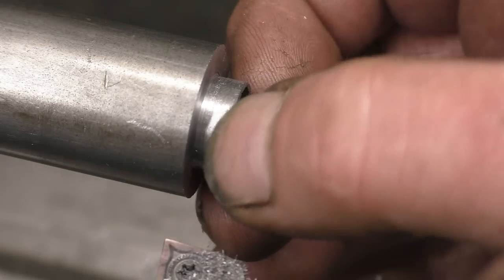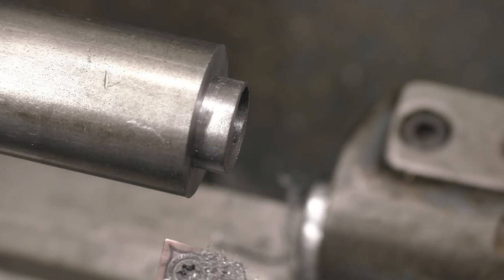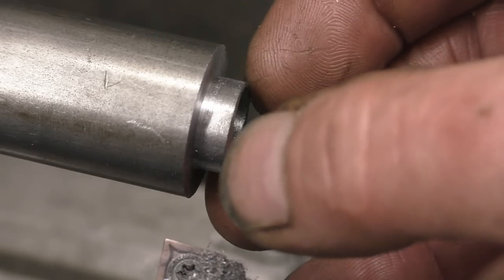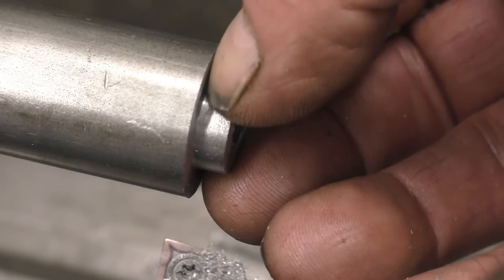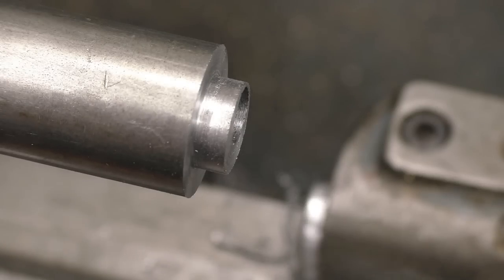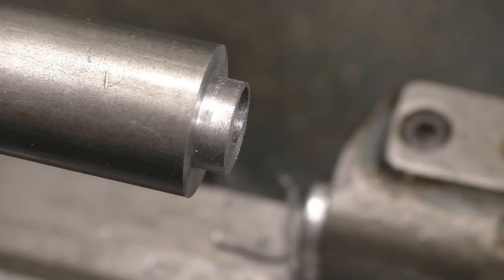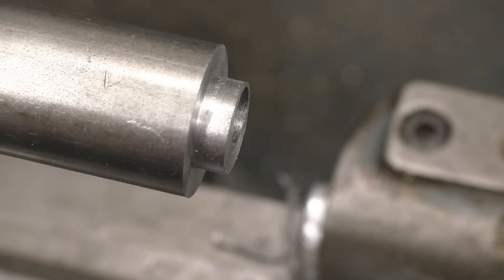Now that is a very, very slight radius in there — it's a very slight one. Sometimes you don't want the radius in there, so you put a parting tool in and just take a very light cut with the parting tool to take it out. And as I've said, often on shafts you need a radius to give it strength — if you look at a car crankshaft or a steam engine crankshaft, there's a beautiful fillet where the crank web turns into the crank journal, and that's purely to give strength.